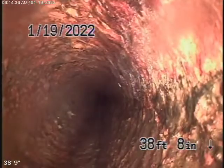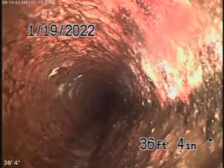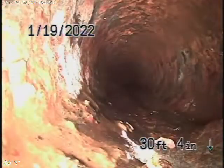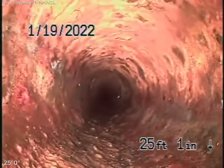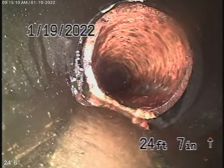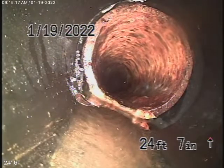It goes to cast-iron pipe, which comes underneath the foundation and underneath the house. This section of cast-iron is definitely getting a little old — there's no doubt about that. It does have some rust buildup in it. It's by no means the worst I've ever seen — it's obviously getting a little old but it doesn't really look too bad. The problem is, if you have a blockage over here, there's no way to clean this line. So either you want to replace the section of cast-iron pipe — if the general inspector says the pipe is leaking underneath the house, then for sure it needs to be replaced. Otherwise, we highly recommend a two-way cleanout installed where the pipe exits the house.